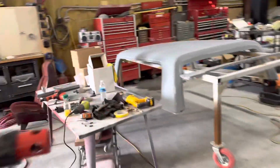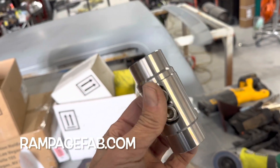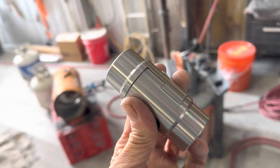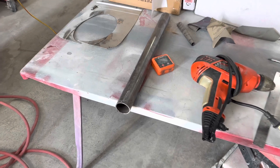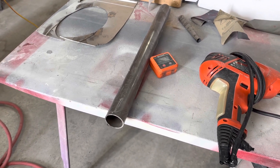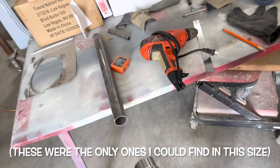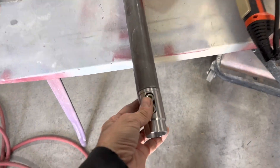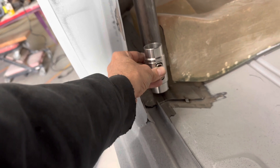Let me show you something else. This is from a company called Rampage Fabrications. These little tube clamps or couplers are a chrome moly steel piece, which was surprisingly hard to find. The NHRA rulebook calls for inch-and-five-eighths, 0.083-wall chrome moly tubing as sort of the minimum standard dimension, and I want to add as little weight to the car as possible. These chrome moly tube couplers work like this: one end goes inside your piece of tubing and you weld that side, then your other piece of tubing slips over the other side and gets welded. What you've got is a removable interlocking joint that will allow me to splice one right in there and allow me to unbolt this from the chassis.